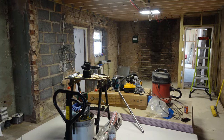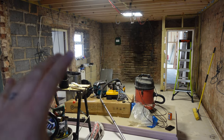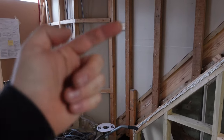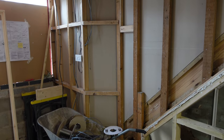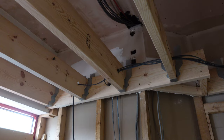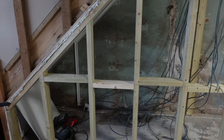Mark everything up. The tank going in that cupboard is just behind this wall here. What we're going to do is pull two 2.5mm² cables in there — even though the boiler man said it only needs 1.5mm², I'm pulling 2.5mm² in case the elements ever get upgraded. The fuse board is going in under the stairs; the mains for the property is just through there. We'll probably drag a split conduit and run it in trunking, drill through the joists, and feed back to our board, fed from a KMF switch in the mains area.